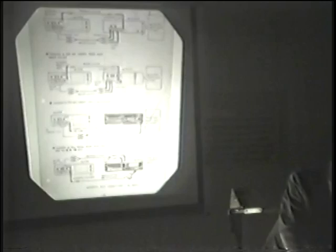Any questions about that? You're using, for instance, the third example there with the camera input. Has anybody tried using that with, say, Brand X VHS or Brand X anything with the camera input? It would work, wouldn't it? Probably? Nope. Oh, actually, yeah, some of the remote pauses are different. Some require a positive pulse, some a negative pulse. Some require a latching too. It depends what they require to do the job.